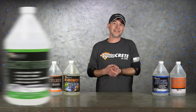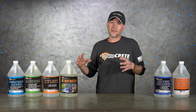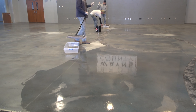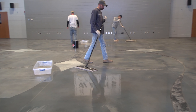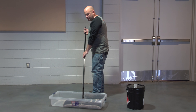Next on the list is acetone, and this is the cleanest solvent that we offer and the fastest drying. It might not be the very best cleaner for that sealer sprayer, but it is the best and most recommended option if you're going to be cleaning a floor prior to putting down a coating. It dries fast, which is definitely a good thing for cleaning floors first, and it doesn't leave any residue behind — the floor can be ready to coat in a short amount of time.